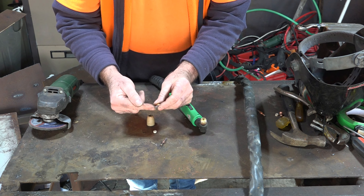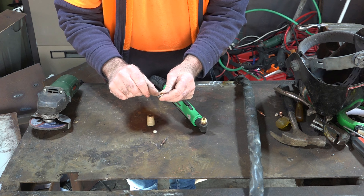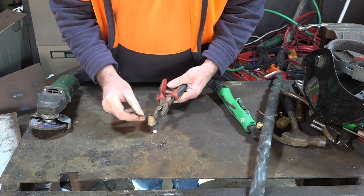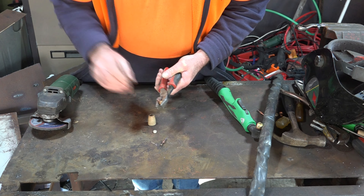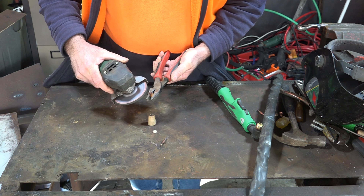What you're going to have to do with this guys is cut it in half - just whack it in half. Trouble is, if you stick it in the vise, because it's quite soft, it'll crush the bottom of it. So what I've been doing is using a pair of pliers to hold it and then try and cut it. The object of the exercise guys is not to crush this little circle set on the bottom, otherwise you won't put it back on your torch. It's quite tricky to cut, but if you use the pliers and just be careful, use an angle grinder or something, it should go right in half.